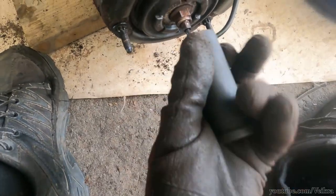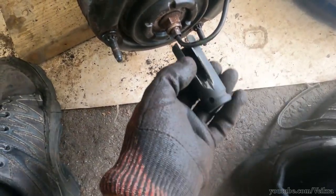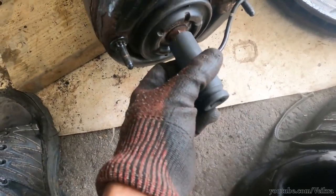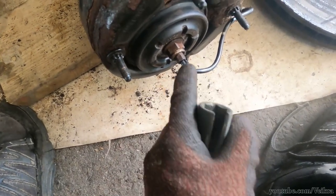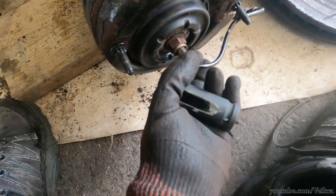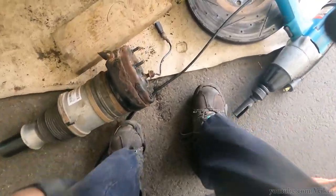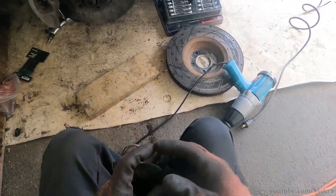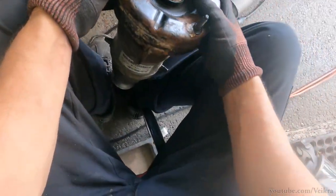This is a tool I made to remove that nut. It's an 18 millimeter and I just cut one side of the hexagon so I can fit in there, and it's not gonna damage the wire as long as it doesn't start spinning crazy. Usually once it's free, you can do it little by little using the nut, and it's fine. Just watch out for this cable - don't want to pull everything out. Now this should be free and we have access to the other nuts on the knee here.